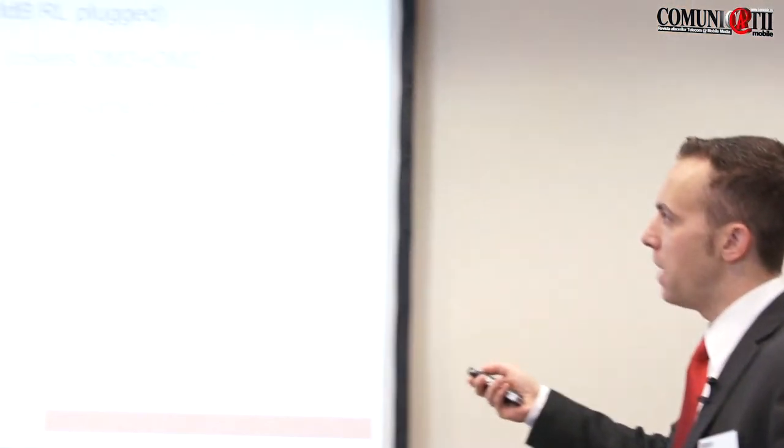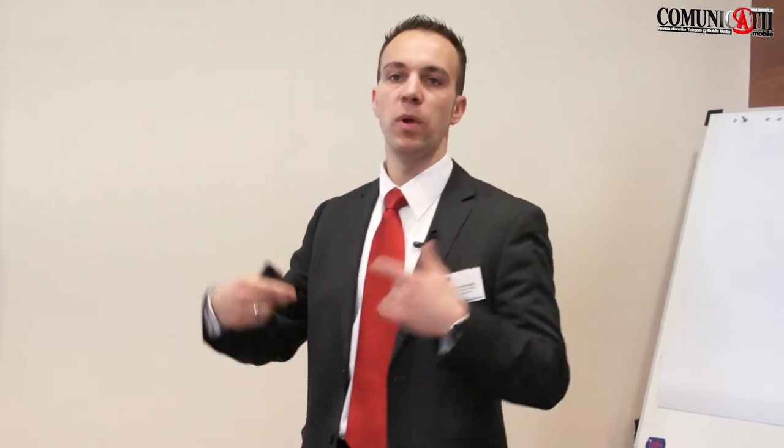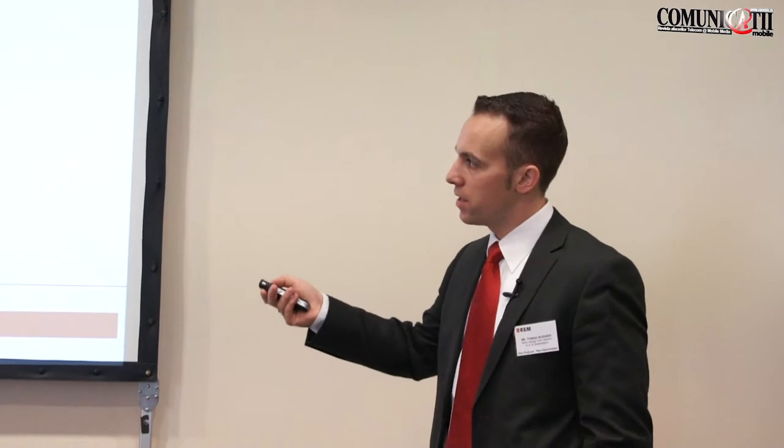Briefly, the features of that connector: the multi-mode connector is grade BM3, which means a maximum of 0.5 dB insertion loss measured each-to-each, and a return loss of 35 dB. For single-mode, you reach typical results of 0.25 dB insertion loss, 0.5 dB max. Importantly, the return loss is higher than 60 dB, which means APC — so you don't have the problem of reflections inside the network. You can use it for 600, 900 micron compact, as well as tight tube fiber types. You can also do direct assembly on 250 micron. If a problem occurs in the network, you can use that connector as a kind of repair kit directly on the loose tube fiber.